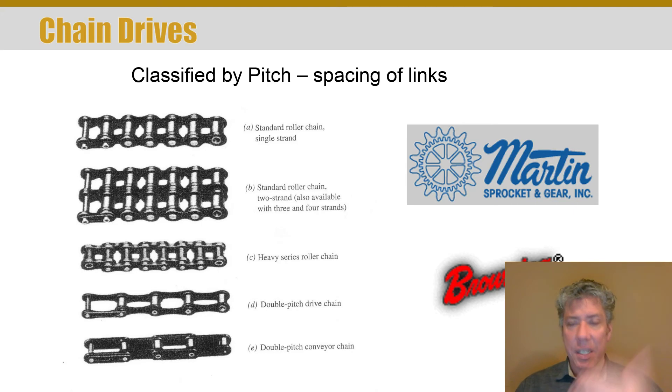Chains are the next step in flexible drives, and chains are classified by pitch — basically the spacing between the pins of the links. There are many other types of drives besides V-belts, synchronous belts, chains, and serpentine belts — especially in smaller sizes, including some that look like a ladder, with many different materials. This is an ongoing area of development with new things being made constantly. Here are a couple of big names that make roller chain and sprockets, though there are many other manufacturers. With machine components, it's not always best to buy the cheapest part — you want components that are well-designed, tested, and reliable.